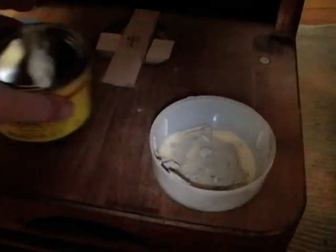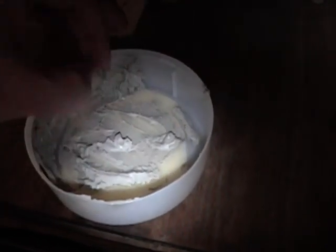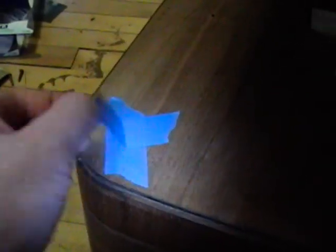I just tried out this wood filler for the first time and it worked pretty well. It's kind of like vinyl when it hardens. It makes a 16 to 1 ratio of this gray-looking substance with a little bit of hardener. You smear it in and it starts to harden pretty quickly. You've only got about ten minutes to work with it before it gets too hard to manipulate. So far I've just plugged up these holes — I put tape over them and then filled them in from the back side. It worked out pretty well. Still a few voids; I'll fill those in from the top side. It's only been about half an hour and it's just about rock hard.